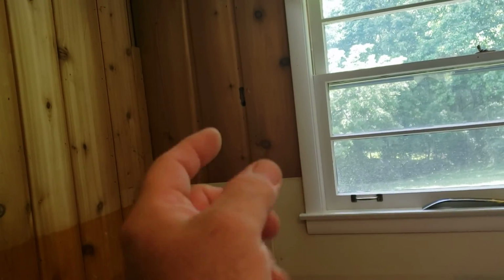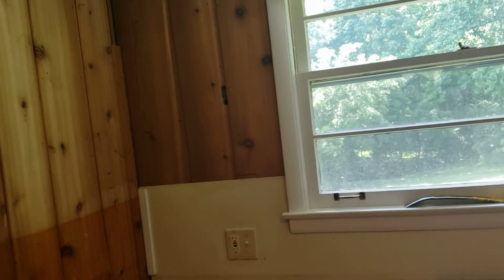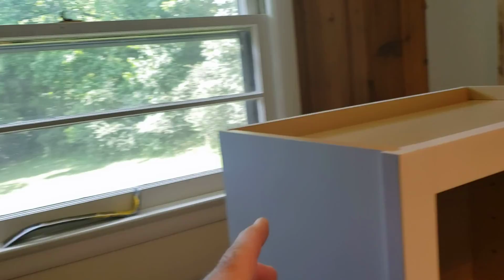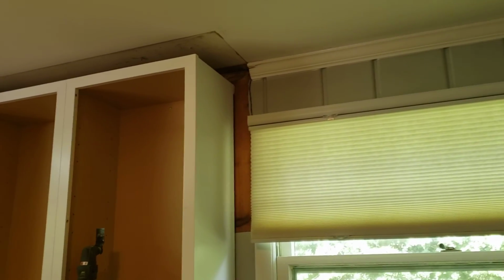We'll take that wall blind corner 2730, transition to a small filler, and then a 9-inch cabinet up against the molding with about a 3/8 reveal, so we can put a scribe molding in there beside it. The cabinets that are going up on the other side of the window are already standard reveal. The 9-inch cabinet that's going here is also standard reveal, so it will actually be just fine as far as matching.